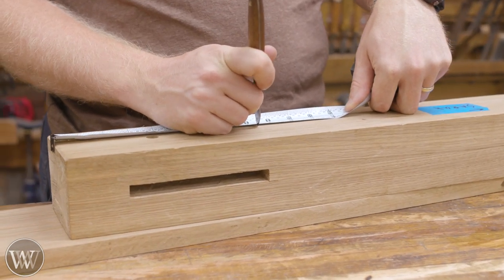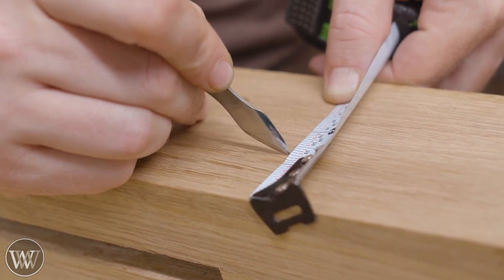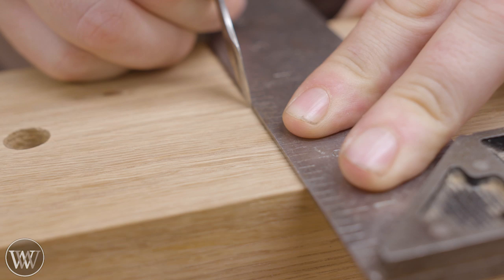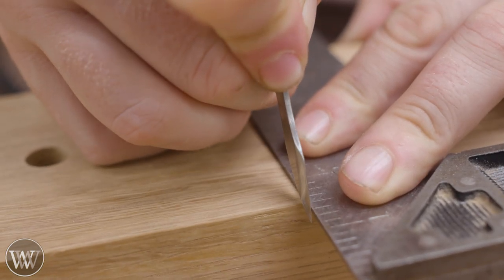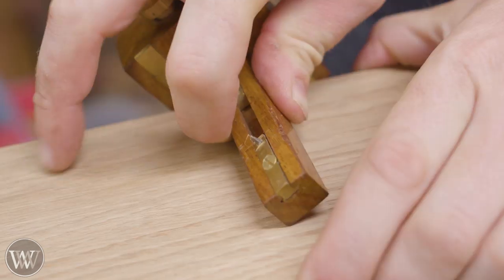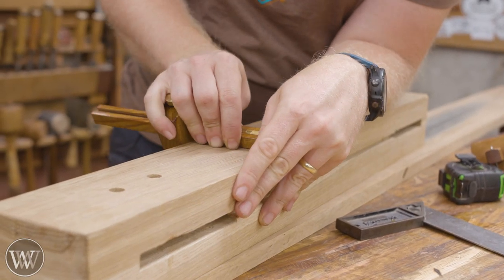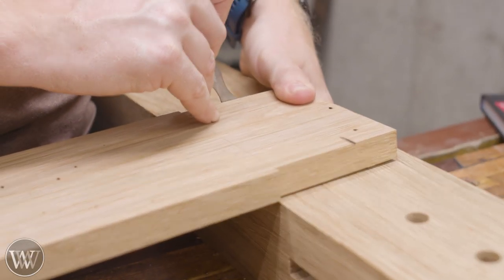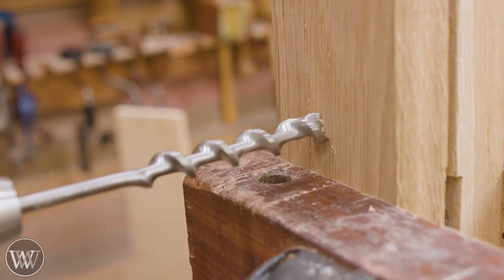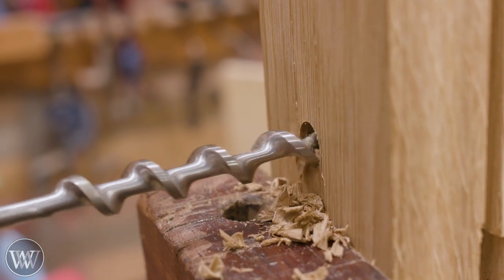Now we need to make the mortise that it will go into. I need to measure up from the bottom exactly where it will be and then make a corner mark — this is one corner of the tenon. What I'll do is bring over the tenon and lay it out, actually measuring off what things are. I used a scrap of wood to measure the actual thickness of the tenon for the mortise width, but for the length I brought the actual tenon over, laid it on top of the possible mortise location, marked one edge, then flipped and marked the other edge. That way I'm using reality as opposed to a measurement which may or may not be accurate.